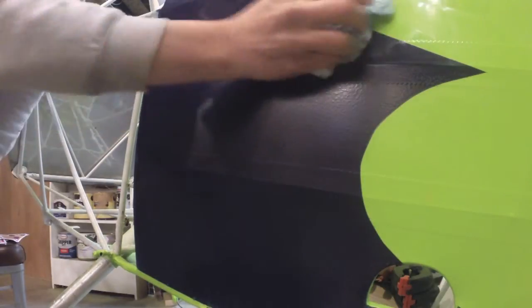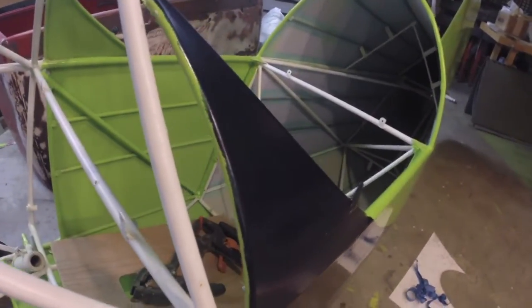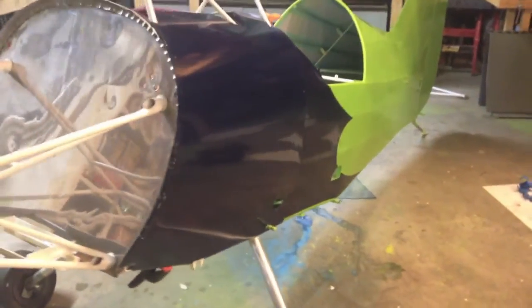That's it — didn't take that long. Look at the finished product: that's a pretty good shine right there. The lower two pieces that haven't been touched yet show gloss, but with orange peel you just don't have that smooth surface to get a nice reflection. Up here where it's been sanded and polished — that's a much nicer reflection. Hard to believe that's all done with a roller. No spray equipment was harmed in the making of this video. Rolled-on latex paint — what a nice finish. Check out wienerdogarrow.com for more information on latex paint.